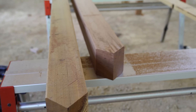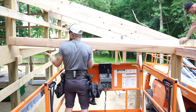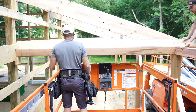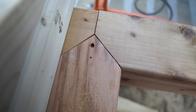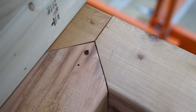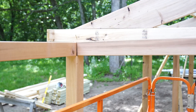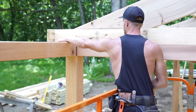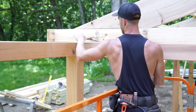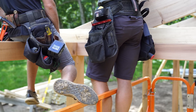We've got some nice 45-degree miters and they're going to sit right into the pocket that you can see on the right side, which we made when we were making the outside header on the porch. It turned out pretty good — nice tight joints, everything's going to look good. We've got some temporary screws just holding it in place and we'll come back with some lags after all of this is framed. It was a little bit tricky getting them in because of the tight fit, so we pushed the header out and then just pulled it back in place since it wasn't fastened. Greg and I are pretty happy with it.